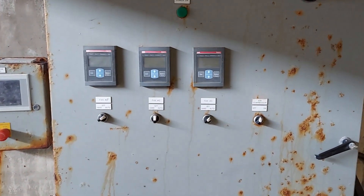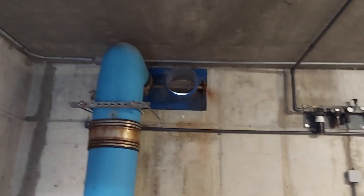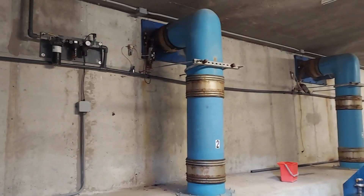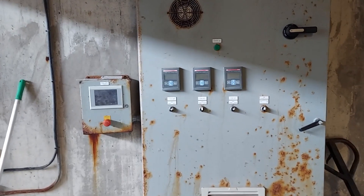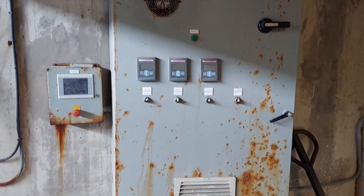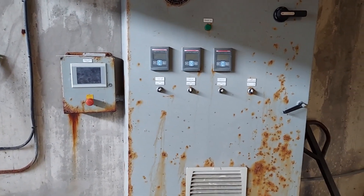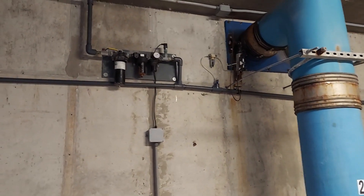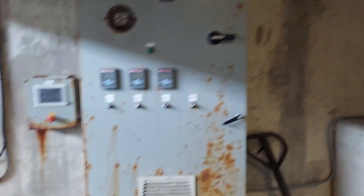You can actually see the front of it here as well. I can control the waves through here, and you can see it also controls my air compressor. The reason it does that is because if the pistons fail or if there's no pressure, the opposite side here would be closed versus this one being open — that's the standard state. So if it detects a loss in air pressure, the pistons won't be able to work, and as a safety it turns off the system. The system will go into error mode, trip the entire system, turn the motors off safely, and on the display it will show a fault in the air compressor. There's an accumulator right there, and that wire going down is my air pressure sensor for the wave maker — it tells the system everything it needs to know.